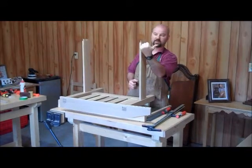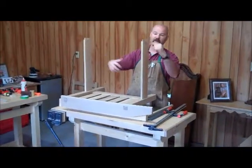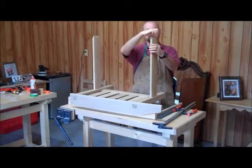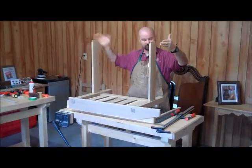My dots are up and towards the outside of the chair. If I'm sitting right here, that's definitely the outside, so I'm oriented properly. With those glued in place, get some glue on these, and I lower the entire assembly on them.